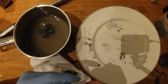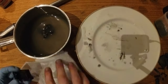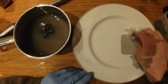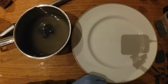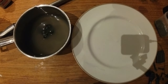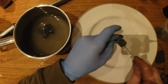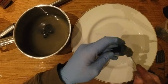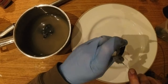Once all the parts on the batch were complete, I would use an airline or even a car tire inflator might work to blow the water off. If you don't have either of these, then you could use a hairdryer, but I'd be careful heating up too much either because you would create a different effect, with obviously parts being a different temperature if they'd cooled down for longer or not, or obviously burn yourself. Just remember, if you've been handling the part after you've washed it, then your hands will be wet too, so be sure to dry your hands also.